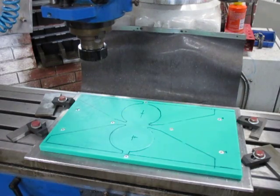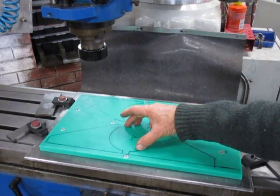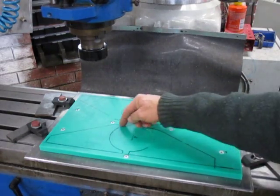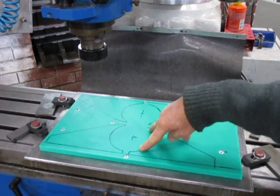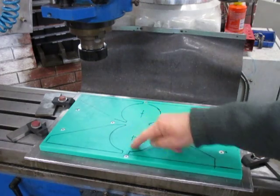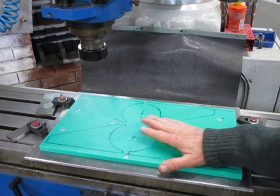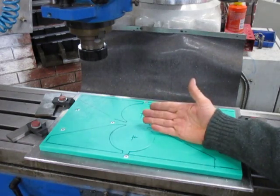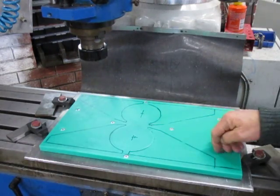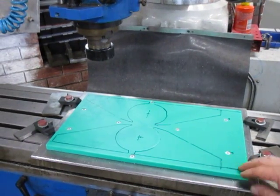Then I'll go ahead and do all the work — drill, tap, fit the inserts, bore out the centre with a 100mm cup drill, and then with a boring and facing head bring the radiuses up to the finished dimension. After that I'll cut this out, some with a saw and some trimmed up with all four blocked together to do the finished facets.